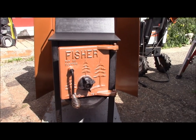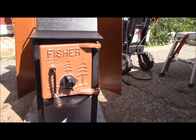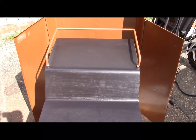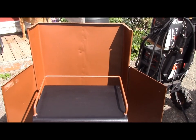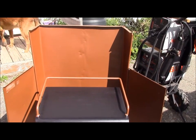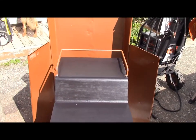So here we are. That's what the stove is going to look like. I decided to paint the door copper, which is also a heat resistant paint. I've painted the whole stove with a flat black high temperature paint, and the top, and then the little railing, the dish rail or pot rail or whatever, and then that's the backing that I made for it. You probably have already seen that, but if not, we're seeing it now, and that goes behind the stove, just a few inches out from the wall, so it shields the wall from the heat. There'll be probably 4 inches of space from that plate to the wall, and then another maybe 4 to 6 inches for the stove